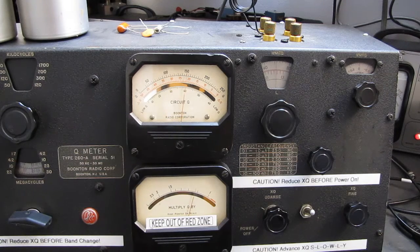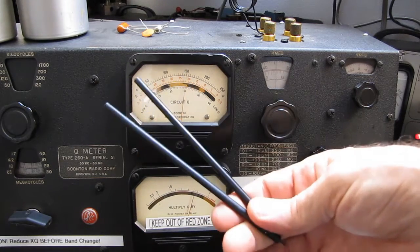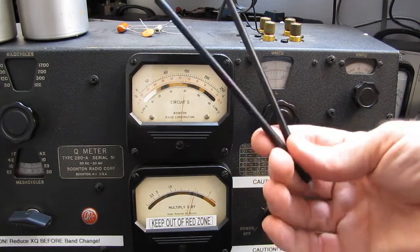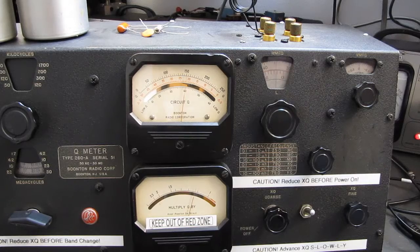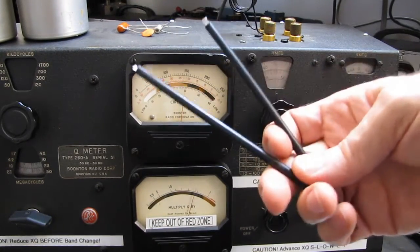Okay, let's say I'm building a coil. I'm winding it for 30 megahertz. Now, you guys remember I had a diddle stick a couple videos ago that was detuning my IF, and I had to go get a new diddle stick because the old one had gone bad, probably too much chemical exposure. But here's two black plastics. Would either one of these make a decent coil form?